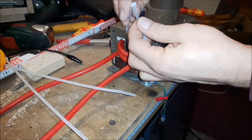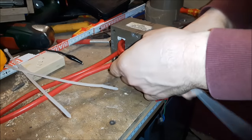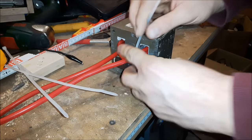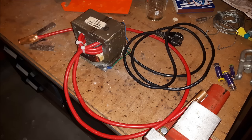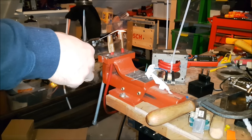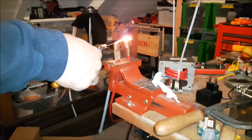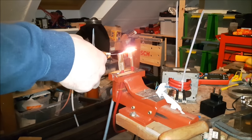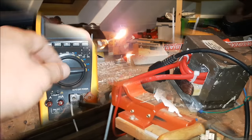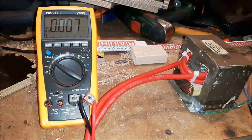I attach some cable ties so the secondary doesn't move around when it's inside the housing. After rewinding, I attached an old mains cable to test the transformer. For a first test, I tried to melt a thick piece of wire — this works. I don't know exactly how many amps I get out of this setup, because my amp meter shuts down at about 100 amps. I think it's somewhere in the 400 to 450 amps range. I also measured the voltage — it's around 2.8 volts AC, which should be safe to touch.